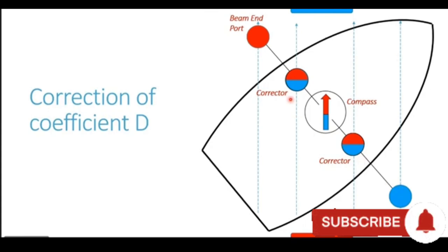Now let's take our attention to the port side corrector. Now in the port side corrector, we are having both the poles, blue pole as well as the red pole, but the pole which is closer to the compass needle is the blue pole. The blue pole is closer to the compass needle, and this blue pole attracts the north red end of our magnetic compass needle. North end of the compass needle having a red polarity, corrector magnet pole closer to the compass having a blue polarity, blue and red being opposite poles attract each other.